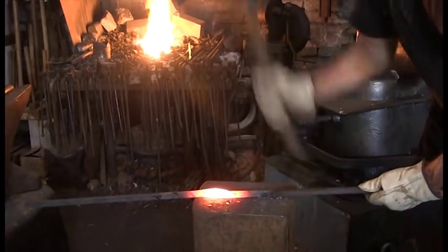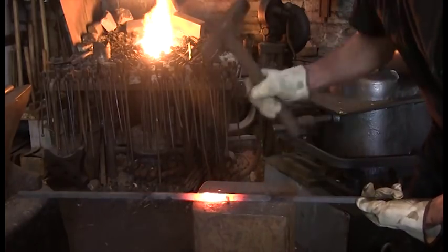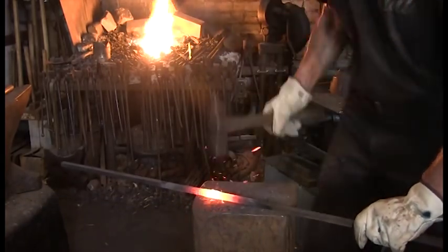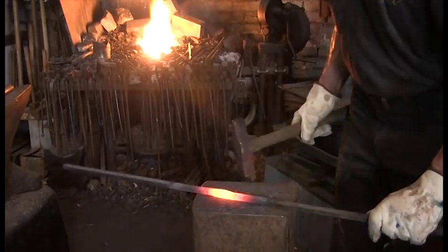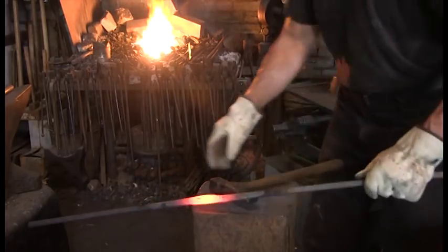My hand is totally loose in the hammer the whole time, but there may be only 1 or 2 blows where I fully cock the hammer. Forge welding requires quickness and finesse, not so much power. I'm moving and hitting from different directions, optimizing my position and stance for the hammer angle I want. If you look closely, you will see all kinds of lateral motion. I push and pull the steel as much as I hit it.